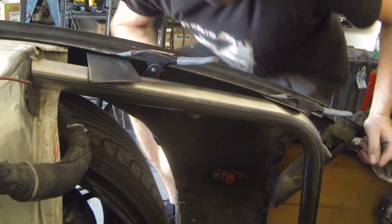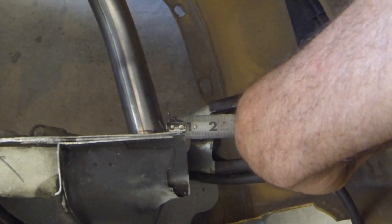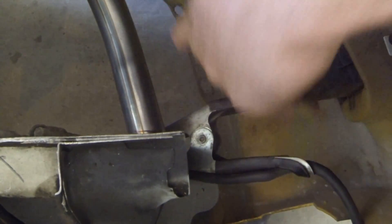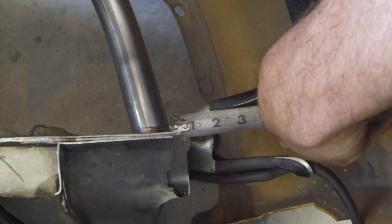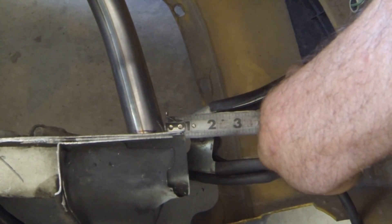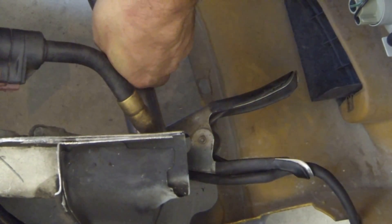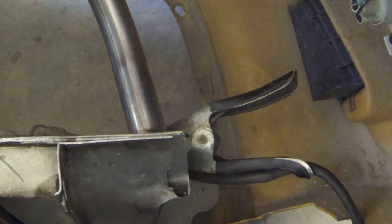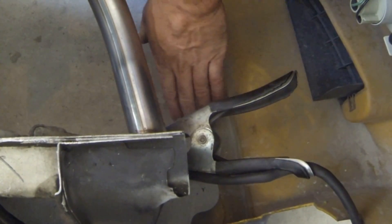That tack weld will hold it in place while I tend to the bottom. The tube on the other side is already placed — I took a measure of that one to the end of the chassis and it comes out to three quarters of an inch. So I'm going to line this up, take a measure, and hold it in place. Both sides of the chassis are going to be the same, and with the other tube already in place, I measured it to confirm we're at three quarters of an inch. I'll hold this in place and throw a tack on it. I also have to verify that the height measurement — from the bottom of the chassis to the bottom of the tube — is also going to be the same, and we'll go measure that one in just a moment.